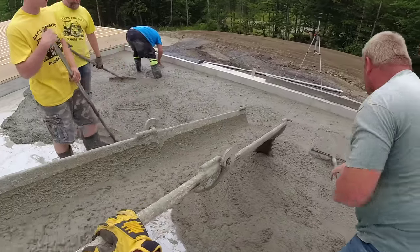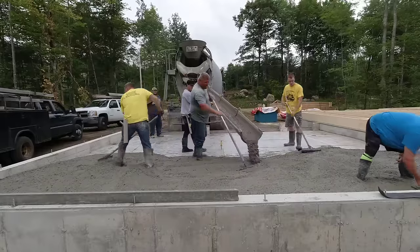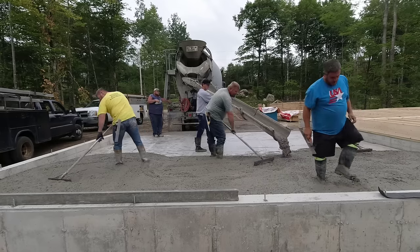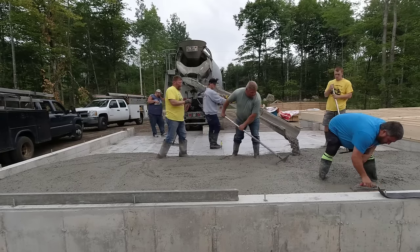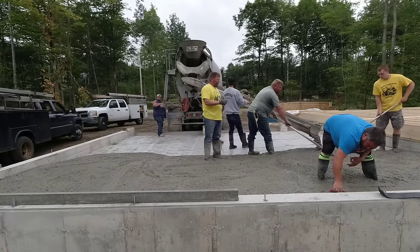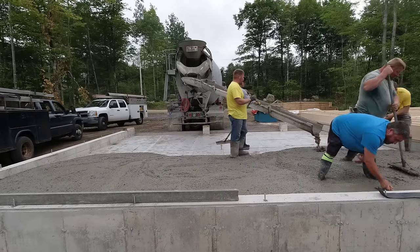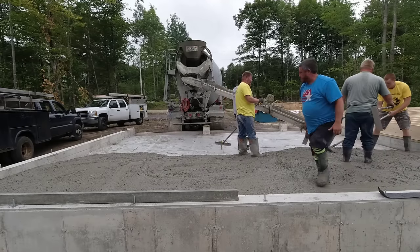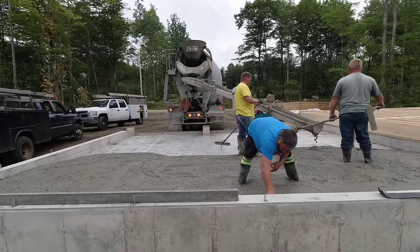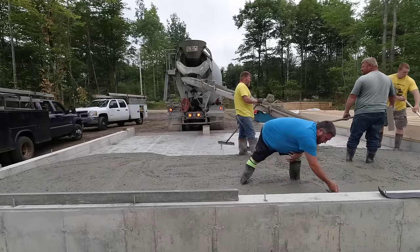What's cool with having five guys, especially with a rear dump, it takes one guy to hold the chute — that's what I'm doing — which isn't too bad because I can kind of control the pace of the concrete. I can tell them to speed it up if we need to, control the flow of the chute where I want it to go, how long I want it in one spot. So in those regards we like having a rear dump. Sometimes it is cool having front dumps, but if the driver doesn't really know what you want, he keeps moving the chute back and forth, backs up, pulls ahead, and it actually takes longer to do it that way if you don't have just the right driver with a front dump.